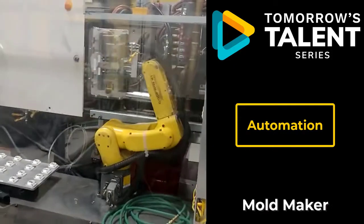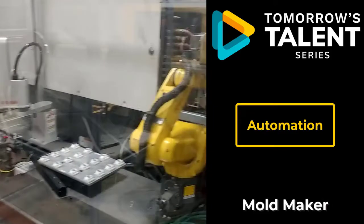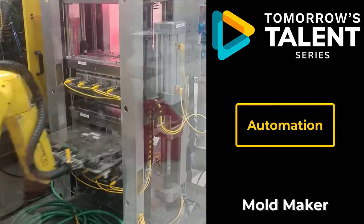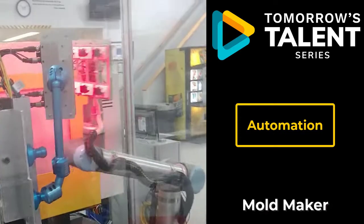Right here we have an automation cell picking out parts from a mold, then transferring the parts into a camera where it's inspecting for any defects. Also it is looking for any of the steel inserts that are overmolded in this tool.